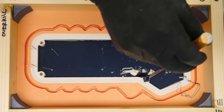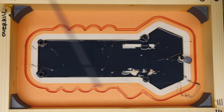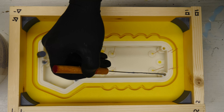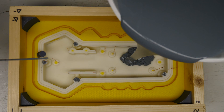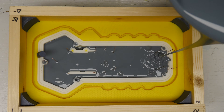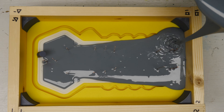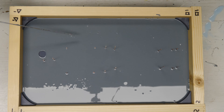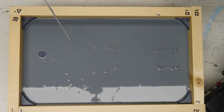Let's pour that. I pour in the middle and make sure the silicone goes down the deep bosses so we don't have any air bubbles and we get good parts in the end. We'll do this to the other part, mixing in some colorant to get a good bubble-free silicone mold.